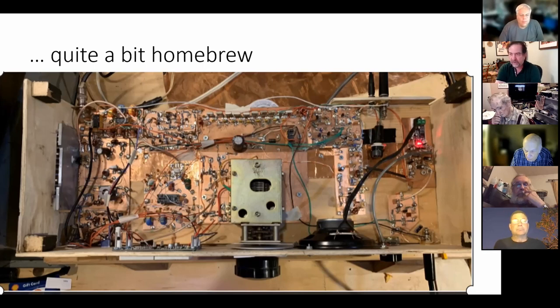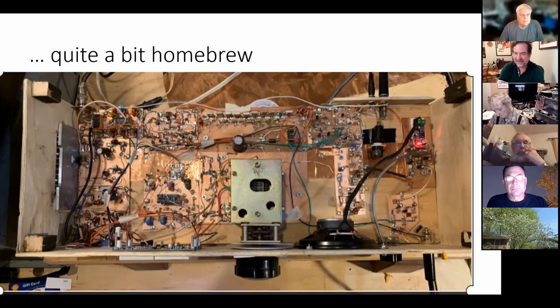Bill, just a quick one. Are you happy with the audio chain going out to your speaker? Yes, I am. And this is something that I learned or relearned from building the Q31. In the Q31, I had one stage of audio amplification from, I think, a single BJT or an FET. I'm not sure. I don't remember. But then it went right to an LM386.